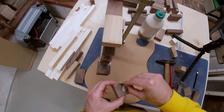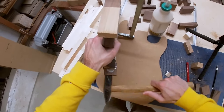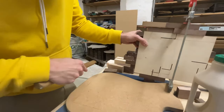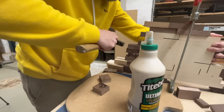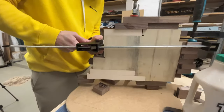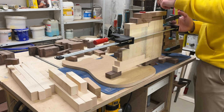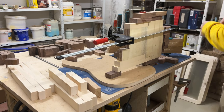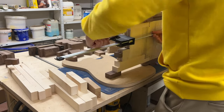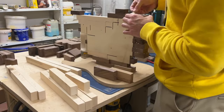I am aware that I am gluing solid wood and plywood together. This can cause the solid wood to expand and crack because it is held together by the plywood. To minimize the risk, I use wood with a moisture content of only 7 to 8%. However, you have to be aware that the risk of cracks can never be completely avoided. Another problem could be that the walnut wood reacts differently to external conditions than maple wood. If one type of wood expands more than the other, this could also contribute to cracking. However, I don't foresee any major problems in this regard.